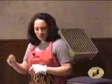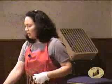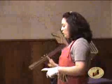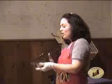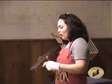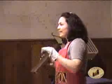You have a question of what do I mean by cutting back? What you do, no matter what your finish is, whether it be oil or shellac, is this: if I had done even my second application here, my dry time on this is about 4 or 5 hours. I'm coming back to do my final step. Over those 4 or 5 hours, a little dust has landed here. Maybe I have an imperfection, maybe even a brush hair. So I take my very fine steel wool. The 4-aught will not scratch my surface, and I literally just go with the grain, very lightly. This is what's called cutting back, and this is what you need to do in between lacquer steps, oil steps, shellac steps, any hard finish.